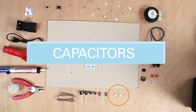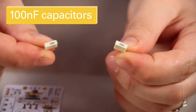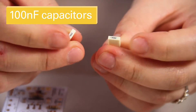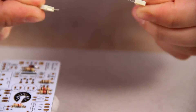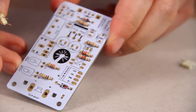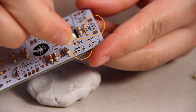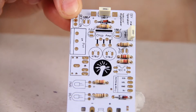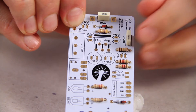You also have your capacitors. There are polyester capacitors and electrolytic capacitors. Capacitors are measured in farads and are used for storing large charges. Your next two components are your 100NF capacitors, called polyester capacitors. It doesn't matter which way they go in as they don't have polarity — so the legs are the same length. After you've soldered your components, feel free to tidy them up a little; it makes the board look nicer and more professional.